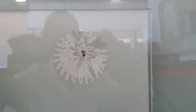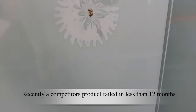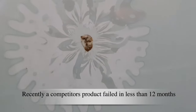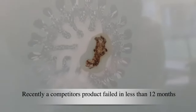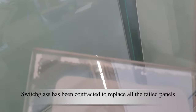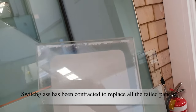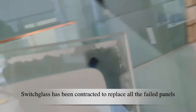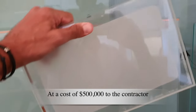What we can see here is some burnout from some Chinese film that we've tested. You can see what's happened is the liquid crystals have started to come apart and delaminate. Here's another example of burnout. These two panels are from two different types of Chinese suppliers and both have failed. The other issue we find with a lot of the Chinese stuff is they tend to delaminate away from the edge. You can see that the film, although it comes all the way to the edge of the glass, the liquid crystals start to be affected, and this piece has really failed.